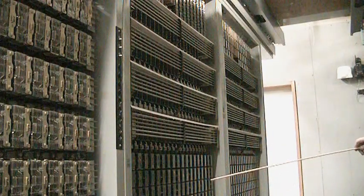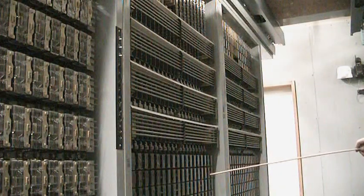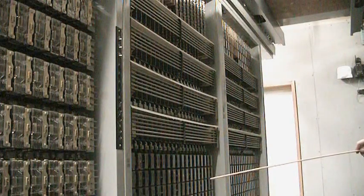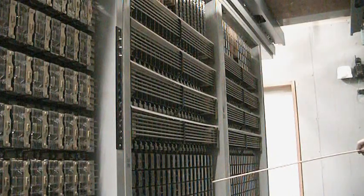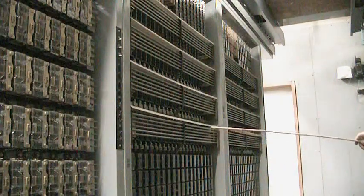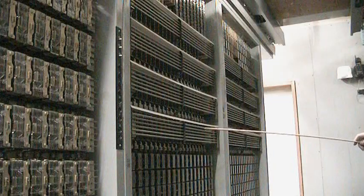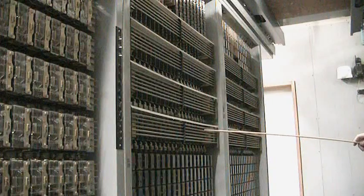The number 3 crossbar was designed as a little office, so they didn't need to necessarily reduce the amount of equipment like in a number 5 due to the size of it. And there is a certain amount of economics involved in making a number 3 versus a number 5. And again, this is a 400 line machine. So every single call that is made, the crossbar switches would operate on, either to set up to an originating register, to get you to an intercom trunk, which is referred to as an IAO, or an incoming trunk call.